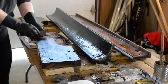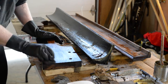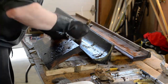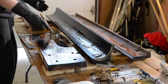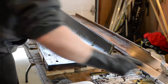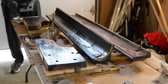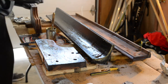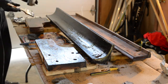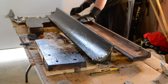I'm going through with steel wool and some putty knives to scrape and remove the finish. I'm not working excessively hard — I'm letting the stripper do the work, and essentially just using the steel wool and putty knives to remove anything that's already loosened up or started to dissolve. You don't get it all in the first coat — you'll have to go back through and do multiple coats. You can see me reapplying the stripper every time I get done with one set.